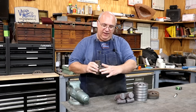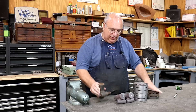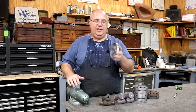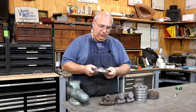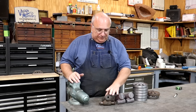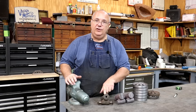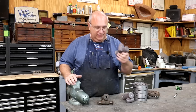There's this casting on the bottom, it has an axle, and basically the wheels mount on either side of this. We were able to get new castings made for three of these casters, three new sets. So we've already worked up the wheels, and we did a video a while back on this, and Clark Easterling over at Windy Hill Foundry actually cast these using the original wheels as a pattern. For this particular part, we actually drew up a split pattern and had those cast, and Clark did those as well. I drew it up in Fusion 360. We 3D printed the patterns and had these castings made here.